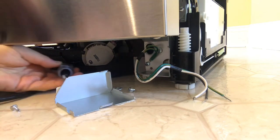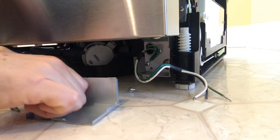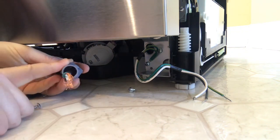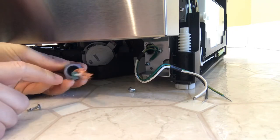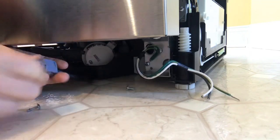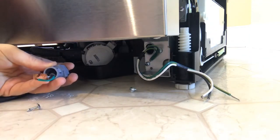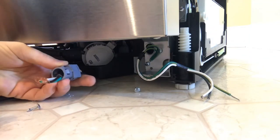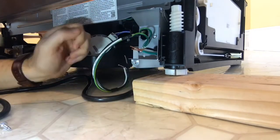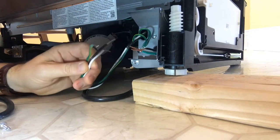This particular cord kit has a little gray plastic junction plug. I should be able to run this right behind the box, push it and it'll click through, and then I just go ahead and connect the three wires - green to green, white to white, and black to black. The plug's actually in. I'm going to connect the wires.